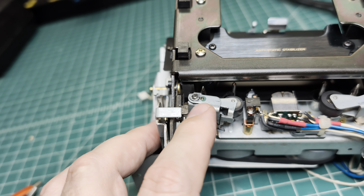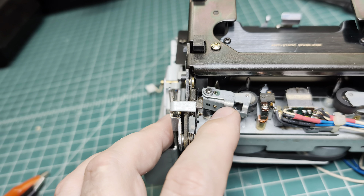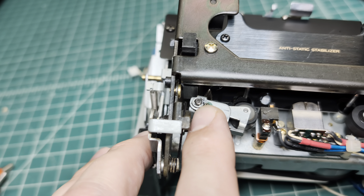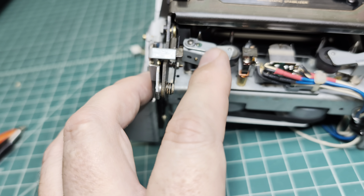What else I see is this deck has a pretty specific mechanism to adjust the left guide. You see this tiny screw here with a green mark — it's locked and it maintains the height of the guide. So we can safely remove the assembly, replace the roller, put everything back, and the height will remain in place.